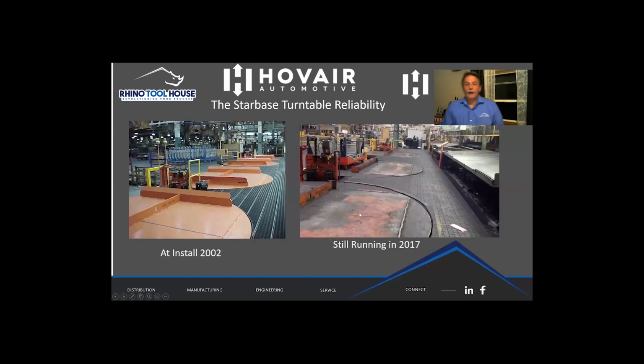So people often ask, the air bearing seems to be a little bit flimsy, but in actual fact, because the air bearing is facing up and runs on the underside of the platen, it cannot or very rarely gets damaged. This is a great example of these 4 turntables were installed in 2002, and in 2017 they are still running. And it's the way that Ford Chicago do the end of all their press lines. So obviously, for those of you who know the stamping industry, they are very unforgiving when things don't work.